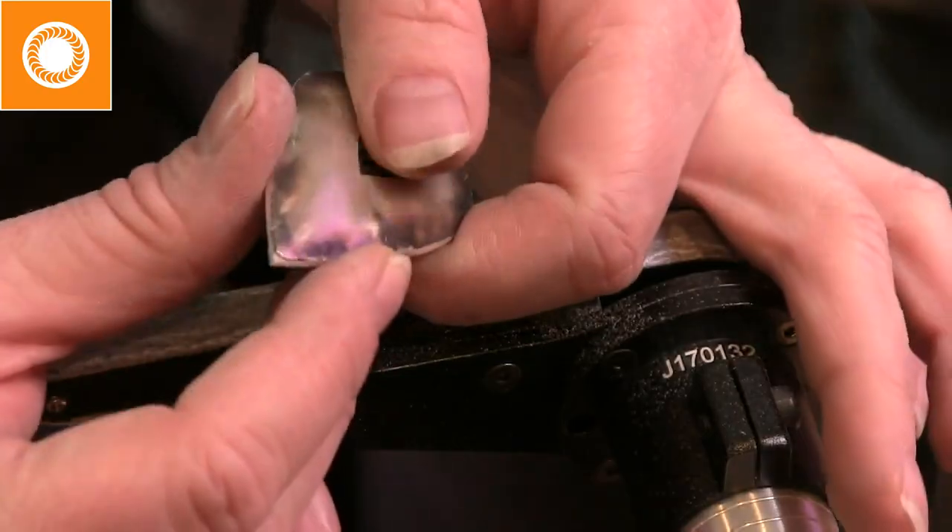Let's pause and answer questions. Someone is asking about the electrode — it is tungsten. So this is a micro TIG welder. TIG is tungsten inert gas. The inert gas I use is argon — I have an argon tank just to the side of my bench. Argon is nice because it's not combustible, but it gives us that shielding gas to keep oxidation at bay, much like flux does when soldering.